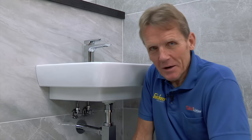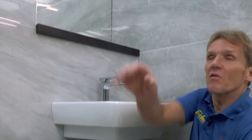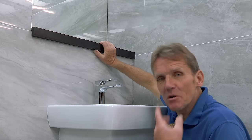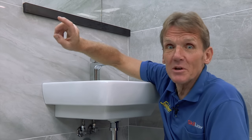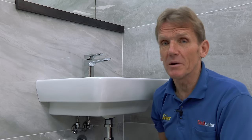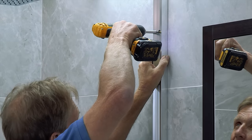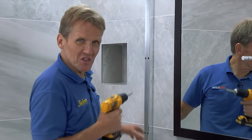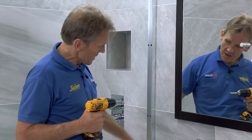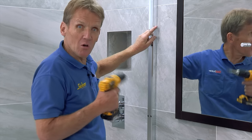One of the things I really like about this bathroom is that it's built for easy serviceability. I've got isolating valves under the basin, the manifold hidden under the shelf so each component can be isolated very easily, and the WC can be serviced entirely from behind the flush panel — making it even easier than a close-coupled WC. Even the seat can be unclipped for easy cleaning. What I've also found is that some people overdo it with the silicone on shower screens — they seal up the inside. You should never do that because the profile can start filling up with water. Just run a tiny bead of silicone along the outside and you'll be fine.